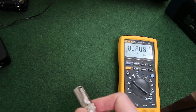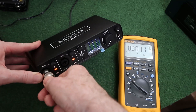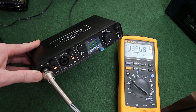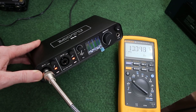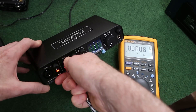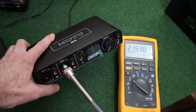If I go back to the M02, there's nothing. If I push the connector in all the way, nothing. If I apply force to the connector, I can get 48 volts, but as soon as I let go, it discharges slowly. This indicates there must be some internal connection problem. I'm obviously connected to the device because the cable wouldn't be registering a voltage, but the internal connection to the 48 volt power supply is defective. I can try that on the second input — I can make connection, but remove my hand and it decays to zero.